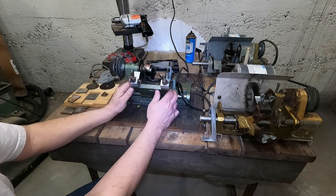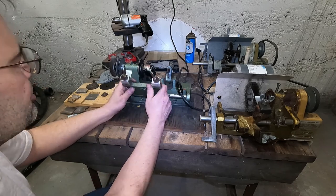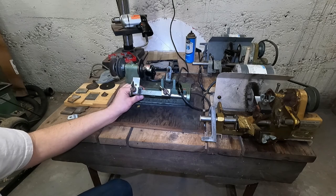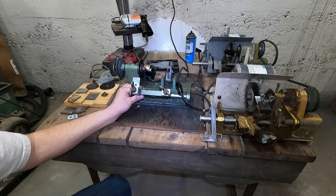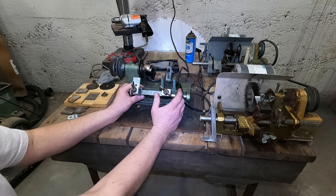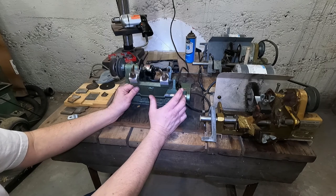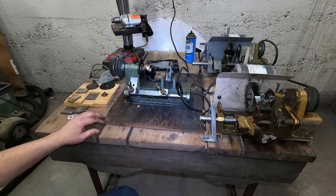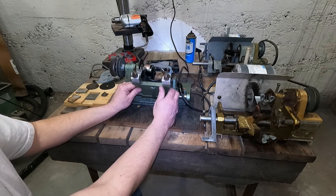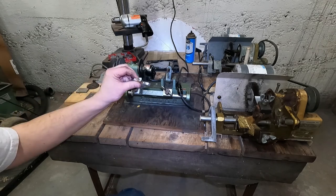What I do is put the knife in the key machine and grind it down to our custom molding profile. The key machine allows you much more control and accuracy. Profile grinding machines for molding head cutters are really expensive — someone like me, a DIY guy or old house handyman, there's no way. But I still want to make some historic molding because I need it from time to time, and a lot of times it's only a couple of pieces. This is just an everyday handyman grinding custom shaper knives or molding knives.